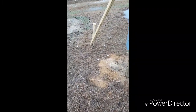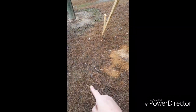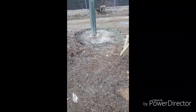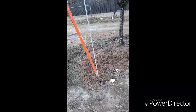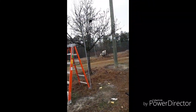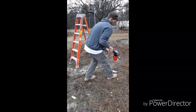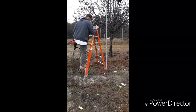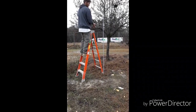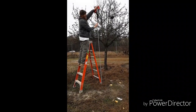The rules from the code are: your ground rod has to be within 10 feet of your panel — ours is. Most of the time it'll also require a second ground rod to be six feet from the first one. The demonstration I'm about to do is showing you the Milwaukee hammer drill driving in this ground rod. Unless you're ten feet tall you're going to need a ladder, so you put the adapter in the drill and then drive it down from there.